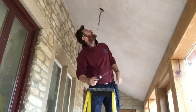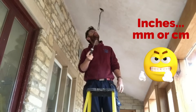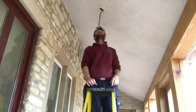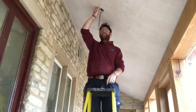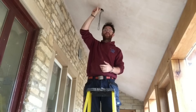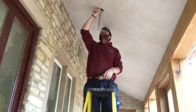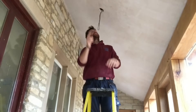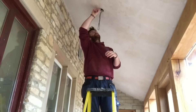You can't see from the camera, however there is four inches of Celotex insulation directly above it. To install these lights I need a minimum of 50mm. This plasterboard has got one inch of Celotex attached to it as well. So the 13mm plasterboard added to the 25mm of Celotex will give me 38mm. I need to find another 12mm to install my lights correctly. There is more than enough space up there — over 50mm — because there is a bit of a cavity as well.